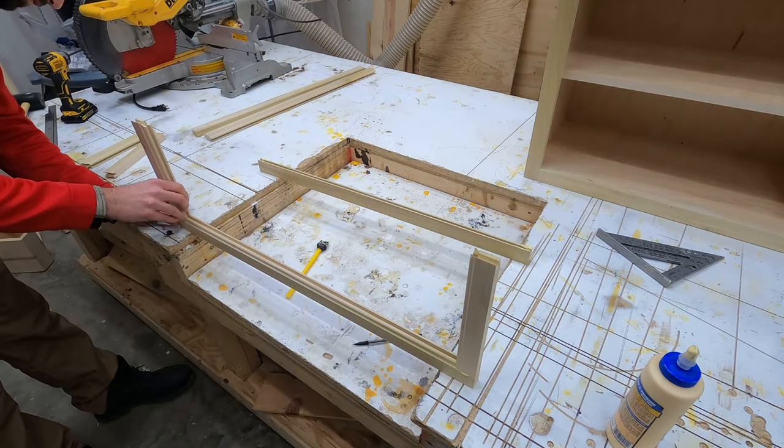The last thing to do before putting the cabinet up on the wall was to put some drawer pulls on the bottom half to make them easier to open. They do make a jig that will center everything and ensure the holes are in the exact same spot, but I don't have one so I free-handed it. I laid the pull down, marked where it would go, made consistent marks on both door panels, drilled holes in the center, and then the pulls can be attached from the back side using the included screws.